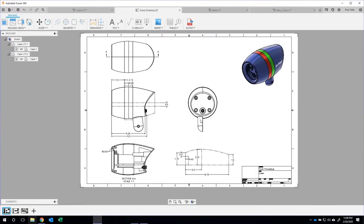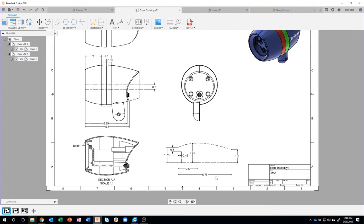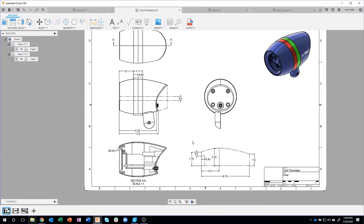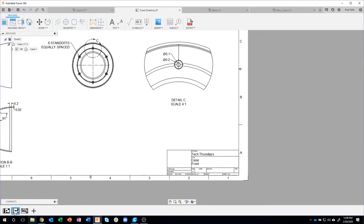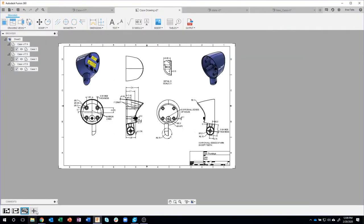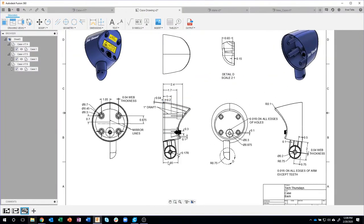Now, I'm going to jump to the drawing really quick. This is also included in the description. And so basically what I did right here is this is exactly what I just created. So you'll see here's my first line, here's my second line, here's my third line, there's the fit point spline, and everything's dimensioned. So these are the dimensions that I'm using to create what I just made, okay? In fact, you'll notice that these drawings aren't fully detailed. They're dimensioned just enough to get you to be able to create the parts using the outline that I've created for you.